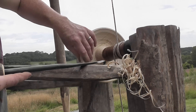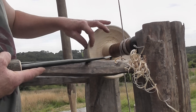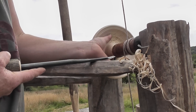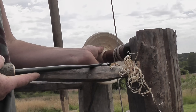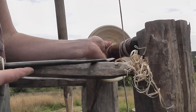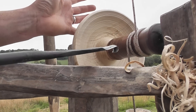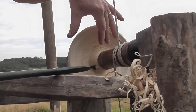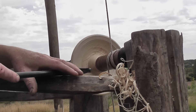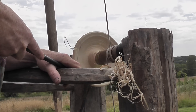After you've got a degree of the centre removed out of the bowl, it's really important that you get this outer edge sorted before you make this central part too thin. The big mistake you can make is concentrating on the middle area, then coming back to the outer edge — because there's a degree of flex in the bowl itself, you get horrible chatter. So at this stage, while I've got about a third to go, I come out to the outer edge and get it sorted now.